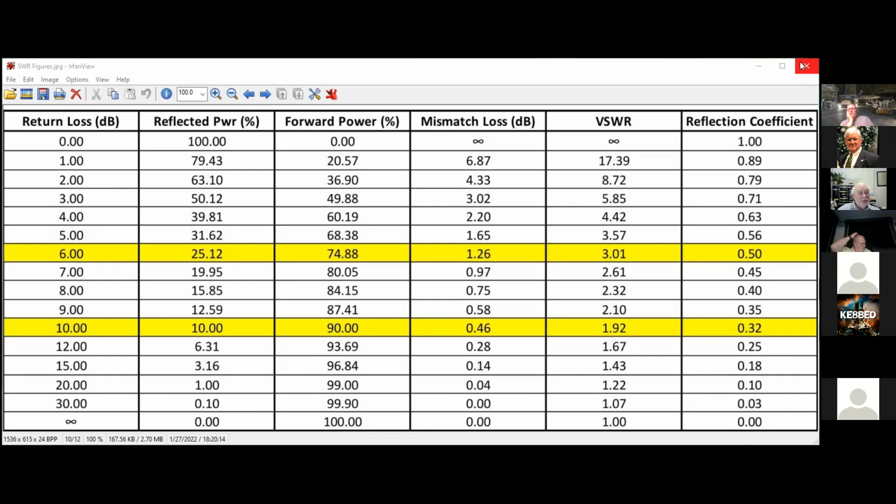I think once you get on the air, you're going to find people talking about SWRs almost like a religion. Most transceivers will have a built-in tuner, and they will only tune if there's a mismatch of, I think, up to 3 to 1. After that, they can't handle it.